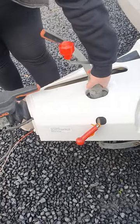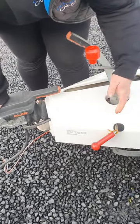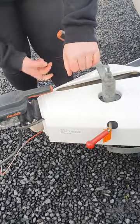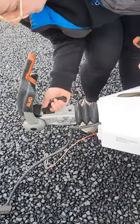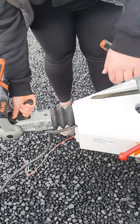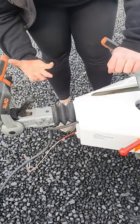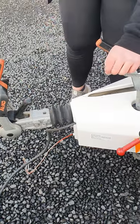When you get to your destination and go to unhitch your van, you'll do that in reverse. Undo this handle, drop the jockey wheel down and tighten it back up, put your handbrake on, lift your secondary lever, then lift and hold this first lever while you wind the jockey wheel up and wind it off your vehicle. If you don't hold this handle up, it won't release your tow ball and it'll just pull your vehicle up. When the handle stays in the upright position, you know it's off the tow ball correctly.